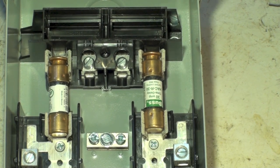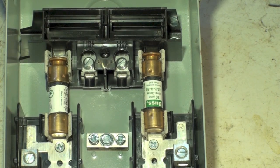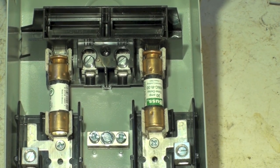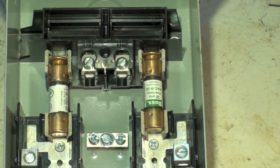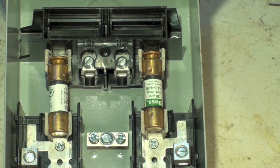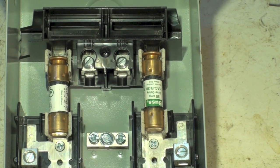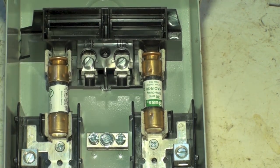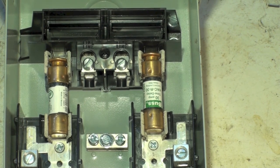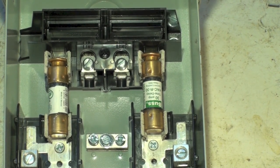This is where you're going to want to put your meter leads. Say you've turned off your breaker and you want to come out and see if there's power here. If your voltmeter is not automatic — if it's a manual — the voltage should be set over 240. Say there's a 750 and a 200 setting; use the 750. Put one probe on each terminal.